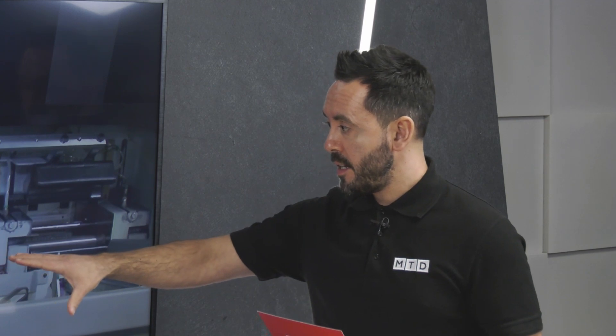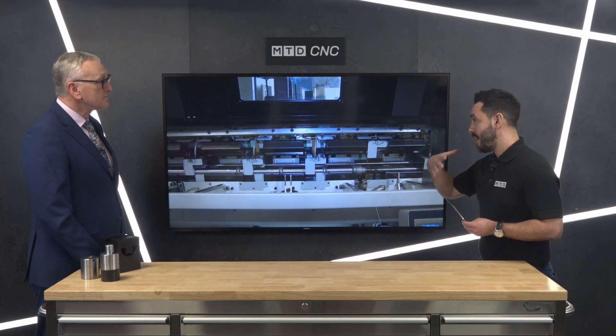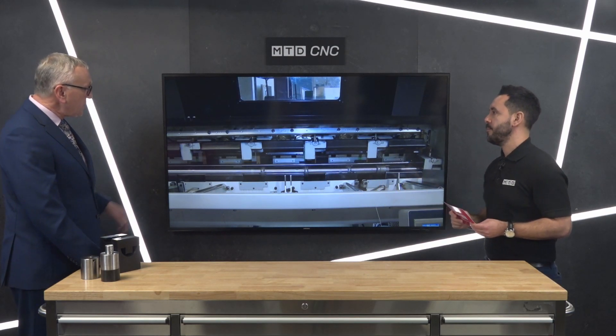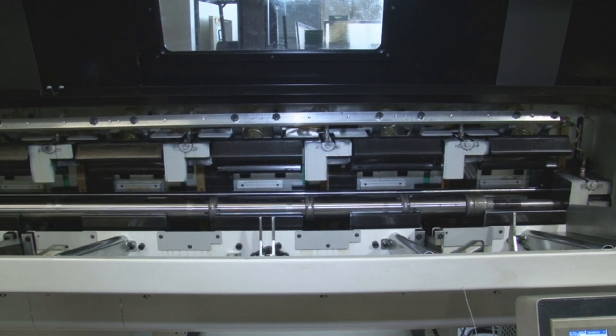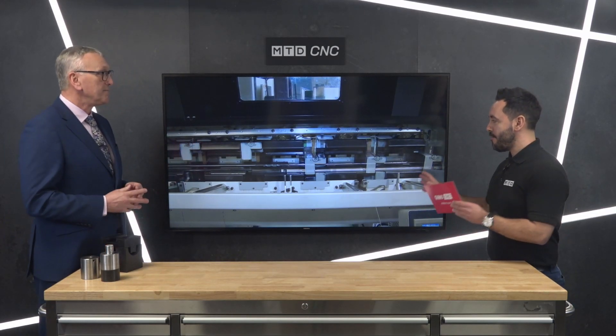There's certainly great flexibility with this bar feeder. Now let's talk about the weight and construction of the actual bar feed and how that eliminates vibration. The weight is in the top of the bar feed to absorb any vibration that may come from the bar. These bar feeds are traditionally around about a ton heavier than bar feeds of a comparable type — designed primarily that way to absorb any vibration that the six vulcanite points of contact can't absorb. It's a nuisance moving around the workshop, but the benefits far outweigh that.